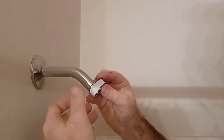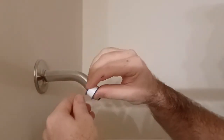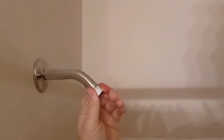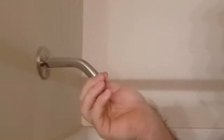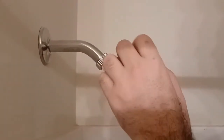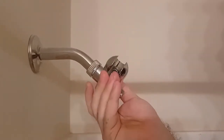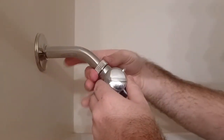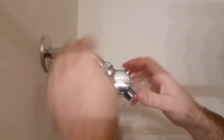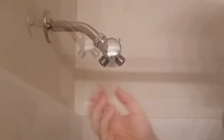You always want to wrap in a clockwise direction if your threads are right-handed threads — righty-tighty, lefty-loosey. Just go ahead and put the tape on there. This has a lock stop — I'm not sure if we'll need it, but just in case, put that on first. Put the rubber down. This is plastic, so you don't want to over-tighten it. Then you lock this against it — this keeps it from tipping back and forth, or at least in theory. So now we've got our valve on there, and we'll get our hose and shower head and continue to work.